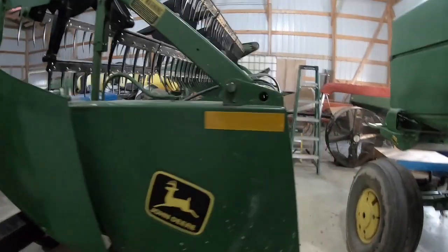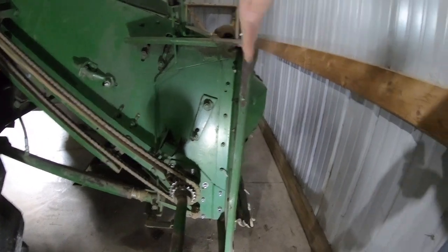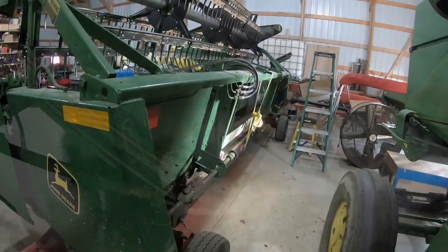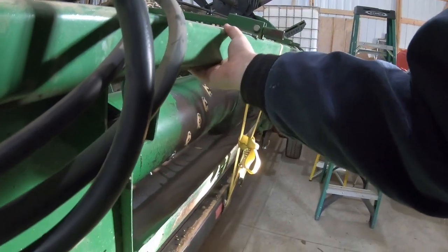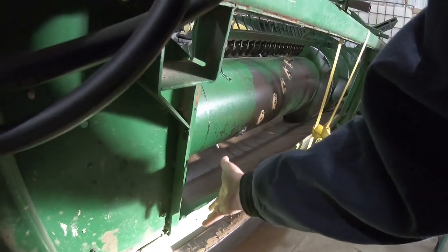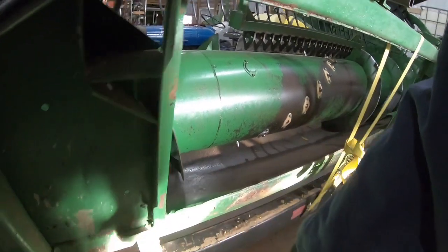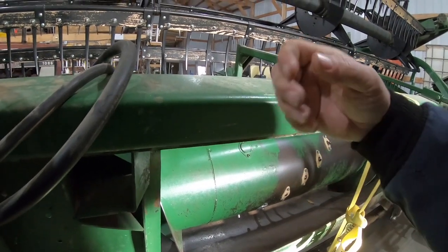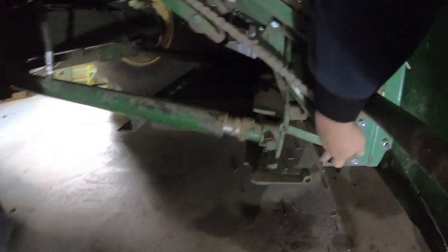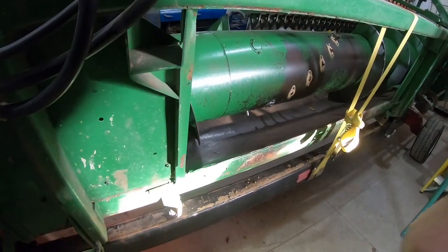First thing I'm going to do is show you how to put the head on. So we get to the field, we're going to do that. I want to show this — I didn't record it when we hooked up to the head the other day. You can see how this is at an angle, and now you see the head right now, the way it is on the combine, it's straight up and down. So when we pull up to it, I can get up underneath here with the top and the bottom's not getting in the way. Where if this isn't on a header cart, then this is going to be straight up and down, and you could run into problems as that head comes up wanting to push against this and you can't get the top lip in. They make brackets that hold that head back — I don't use them — but that's why it holds the bottom of the head back against this point right here, and that way you can hook up to it. Hopefully that helps make sense. We're going to hook up to the head now.